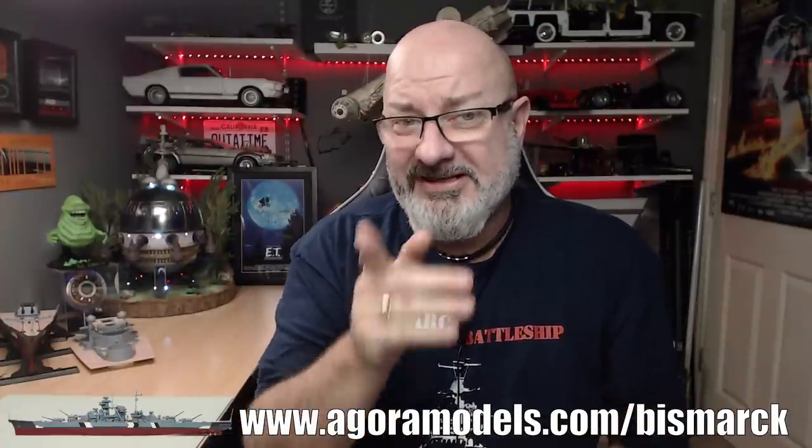Now, the warning. When you do this build, whatever you do, do not try and test the lights or the electrics, as in the motors, until you're told to do so. You're going to see I've put a great big warning sign up on the screen when we are actually playing with LEDs. The reason being is the control board that they give you at the start is only for testing motors. If you try and plug that into one of the LEDs, you're going to blow them. So I'm just going to give you that warning now. And then when it does tell us later on in the build, you can test them to your heart's content. But we're going to enjoy this one. I really do hope you enjoy it as much as I enjoyed building this one.